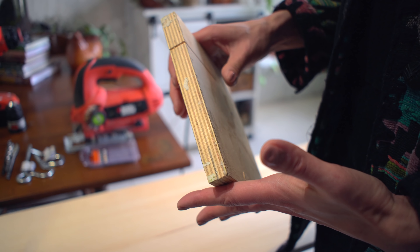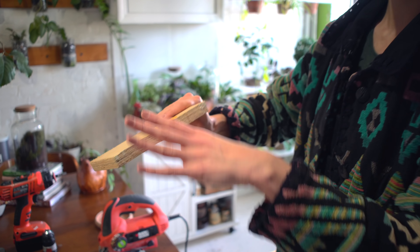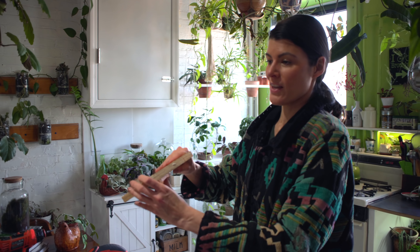One other reason to use a laminated piece is that wood tends to warp over time depending on humidity, moisture, or if it had been sitting outside — even bringing it in from a different region can cause it to warp. What's beneficial about laminated wood is the cross-grain pattern: the grain goes this way, and then the other layer's grain goes the opposite way. So even if one layer starts to warp, the one below it will warp the other way and maintain a durable structure. So let's talk about the other tools you're going to need.